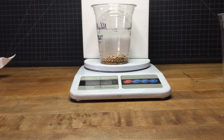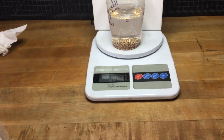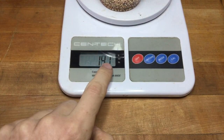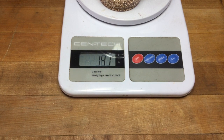That looks good. You can see that our weight is 141 grams of bronze. And so that will be our volumetric calculation. Then you can add 10 to 15 grams for your button, or do a 20% weight calculation.